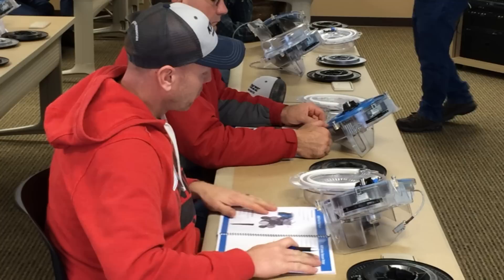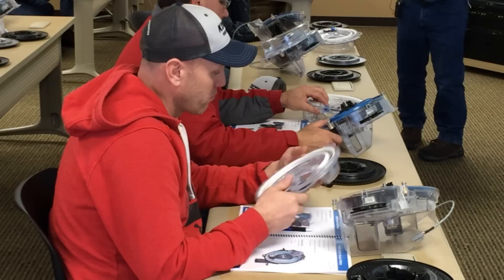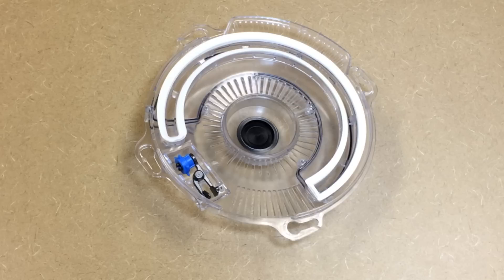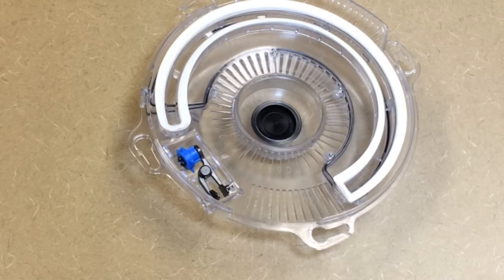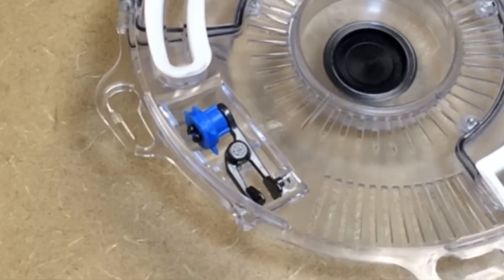While we are looking at the vacuum meter housing, we notice the little spiked wheel down at the bottom. This is our debris ejector. The sole purpose of that little wheel is to specifically ride along the back side of the disc, and if a little piece of debris gets caught in that orifice, it will poke it out to make sure every pocket is getting vacuumed and every pocket is filled.